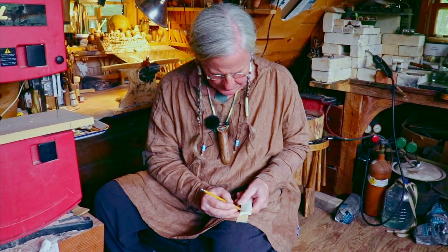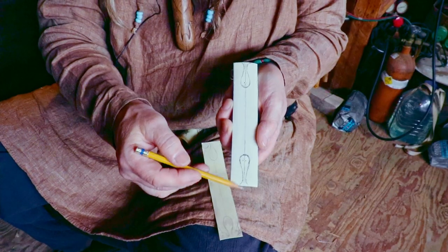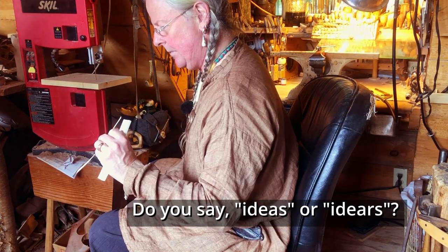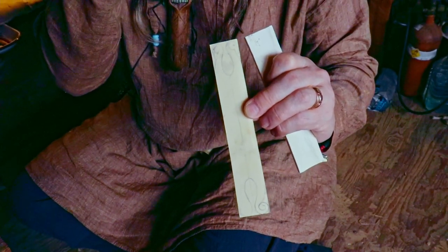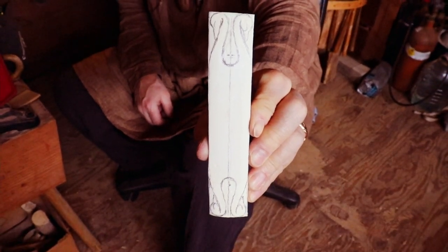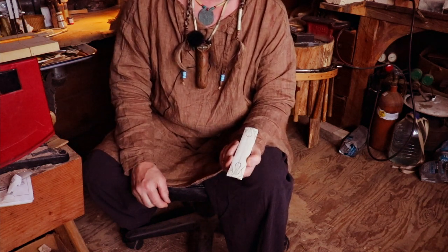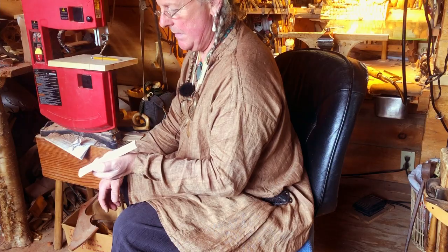The actual gap between the two ears is going to be fairly narrow to start and then swell out. This is the working part of the shuttle — you wind your weft thread onto that, and then this will shoot through the shed. Now comes the fun part. On my sketch, I was playing around with several different ideas. I kind of fell for the swan or duck — so that's what I'm going with. This is it, drawn on anyway. That shows up pretty good. Now this is the radius I was talking about down in here. I'll saw this all out on the bandsaw, but when you're chipping around the corners down there, it never comes out perfectly smooth. That can be taken care of with files, but I think it might be handy to drill through it and make a nice, smooth cut.